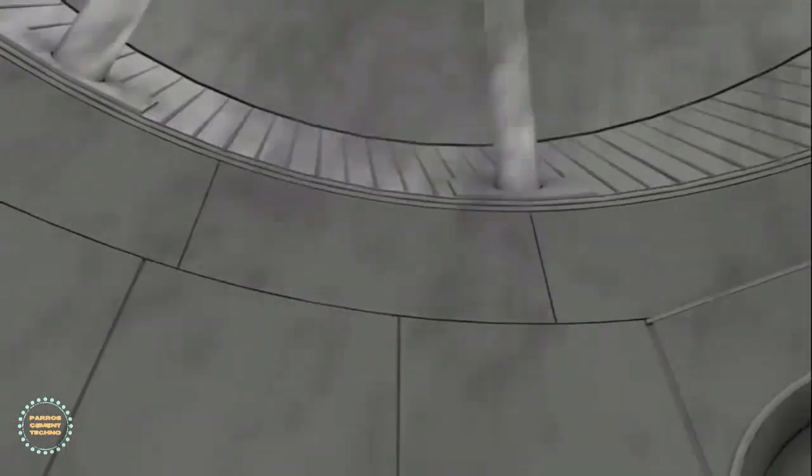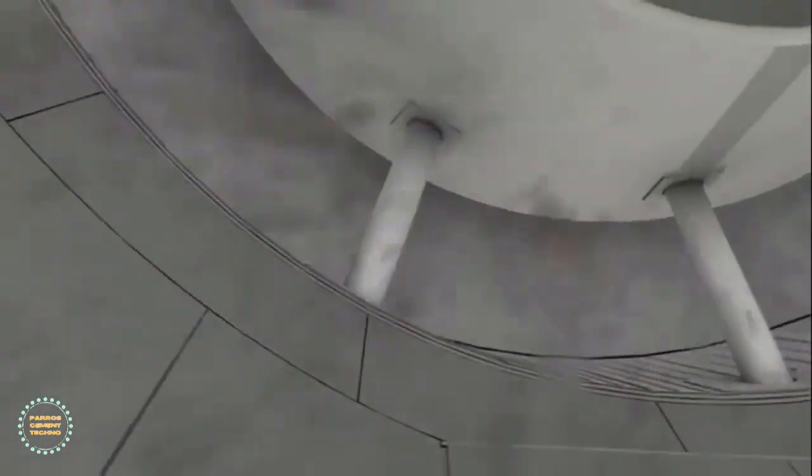The inner part of the patented grooved roller profile evens out and consolidates the material before it continues to the next roller. The outer part creates highly concentrated grinding pressure, allowing air to escape through the middle ground. Partially ground material passes into the hot gas stream, which also provides drying capability, and moisture in the materials evaporates almost immediately.